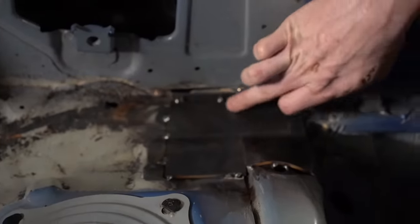I'm just going to make one adjustment, and that is to add about 2 degrees to this bend. And that should center the tube on our front box. It's pretty common to have to make slight adjustments like that, just in terms of the amount of the bend, or if something sprung back more than what you thought it would, then you would need to add a little bit on each bend. But yeah, the fitment's really good.